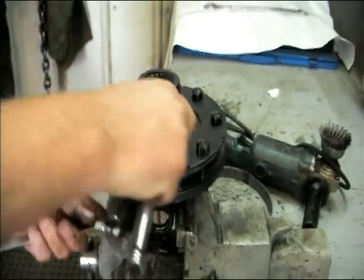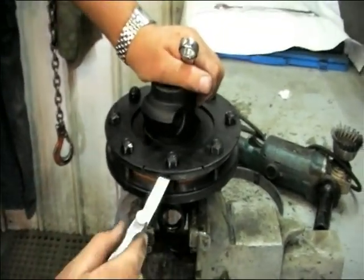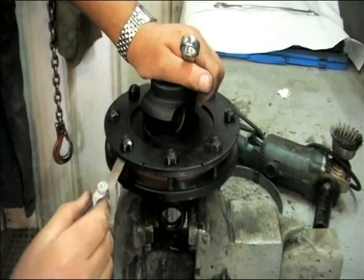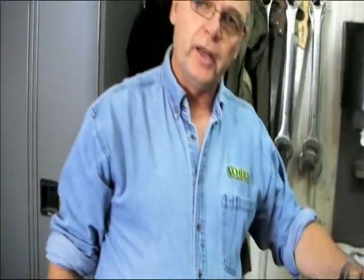If you tighten it up too much, you'll start putting clamping pressure on the clutch and it will not function as intended. So that's just about perfect right there. Once you have it set, you're going to need to run in the clutch a little bit because, as soon as you've taken it apart, it's going to have about 60 to 70% of your torque value. Be careful when you run it in that you don't overload it too much. It won't hurt the clutch to smoke a little bit on the first couple of slips — every time it slips a little bit, it will increase the torque until it gets to its nominal value. When you replace the clutch or the driveline, always make sure that you put the retaining bolt back in and secure it properly.